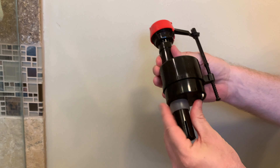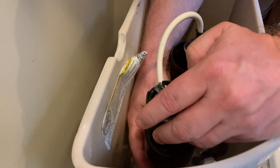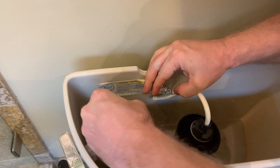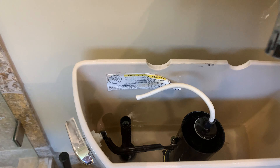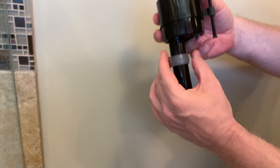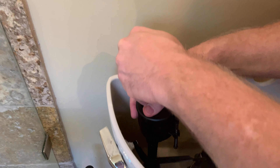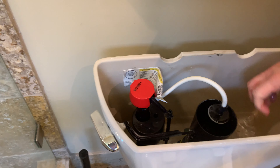While that drains, we actually don't need to pull the chain off. The water is already off and the toilet is drained. I'm gonna pull it up just to drain as much water as we can and leave it held up. Now, can you see this down here? There's a little piece on the bottom — I'll show you on this one. We're going to lift this; this tightens it down. We're gonna lift that so the component comes off. I take that little gray piece and pull it up. Once that's up, I'm gonna unplug this — there we go. Now this will come right off.